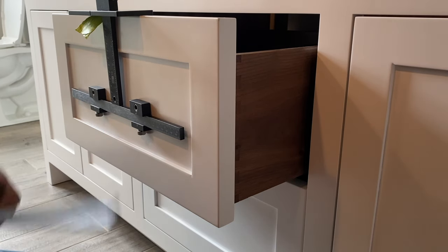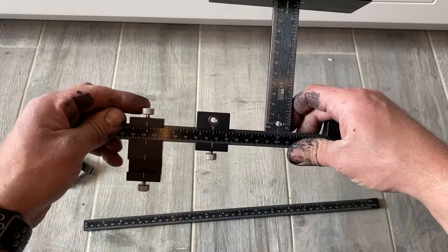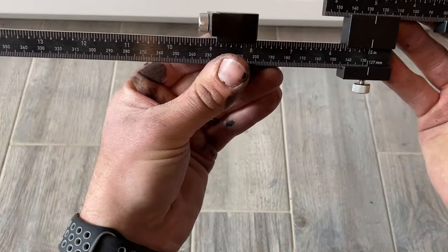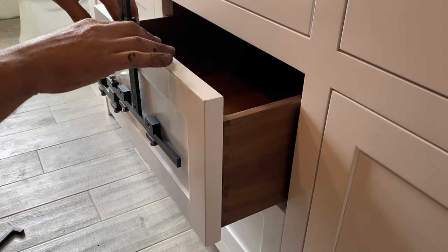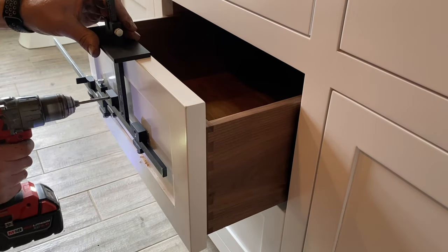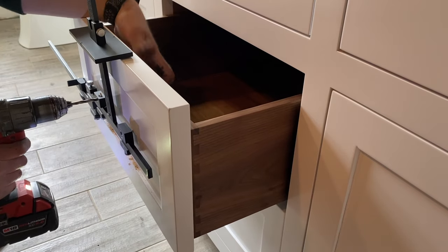That's where we're going to use the extension. Ready to drill — I've got downward pressure here, push this all the way up against that stop. I like to get my hole started, then I take my block and put it in the back to prevent blowout.